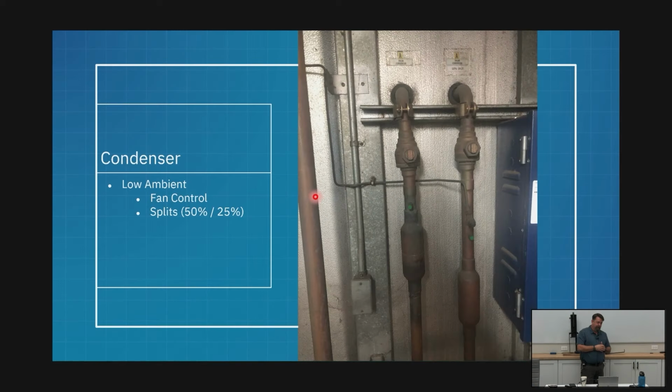So that's probably going to clear it. We can use a magnet to detect where the plate is that seals. We can detect that with a magnet, feel it, give it a whack, and see if it moves. Often it will. But that's what it's going to look like. What we're going to see is a lot of ice, because I'm trying to pump out one circuit, and it's constantly being recharged with liquid refrigerant because it's leaking. So I'm constantly pumping it out.